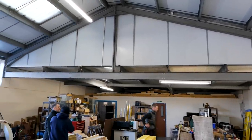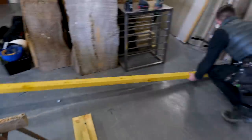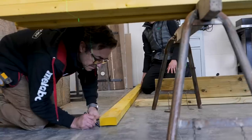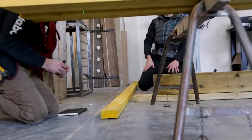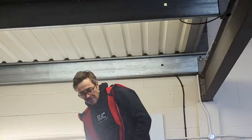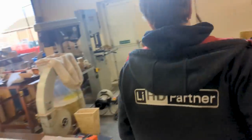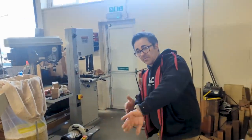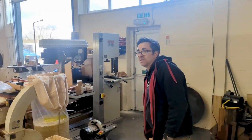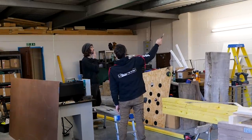Lloyd and I started setting out for real now, with all the material in. We thought we'd start by putting the longest wall through under the really bendy steel. We had some lights in the way, but the first thing was to get all the sole plates in place and do the layout. Normally in an industrial unit the screed floor would be nice and flat, but this one was all over the place. By unclipping that light, Matt, we can now bring our head plate more favourably into the steel line.